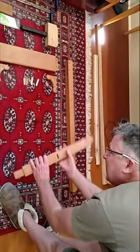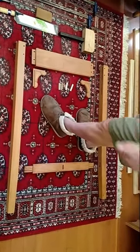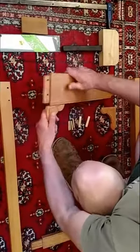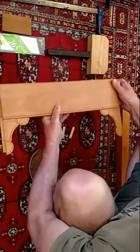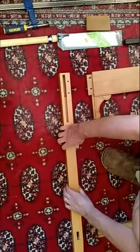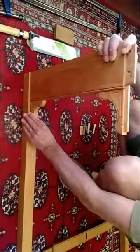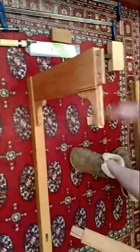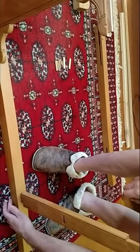Basically we just push this together, then pin it and wedge it. We start here — the brackets go this way on the outside and we just push that in. We take the other bracket, push that in; it might be a little loose, that's fine. Now we take this leg and just roll it up like this. Then we push it in like that — it should be kind of flush with the top. Then we take the cross stretcher, so the LL is on the outside there, and just push it in. It's not going to go all the way because it's a through tenon.